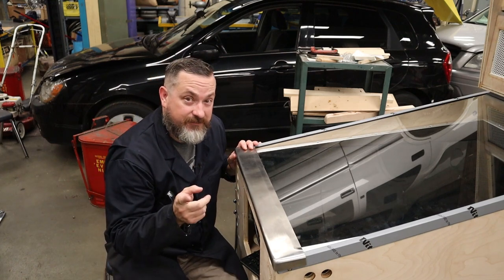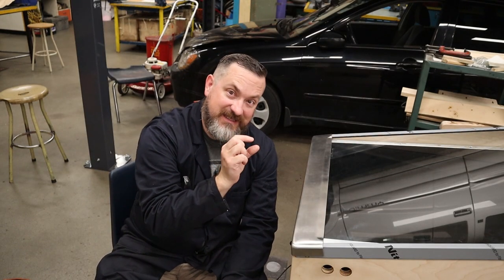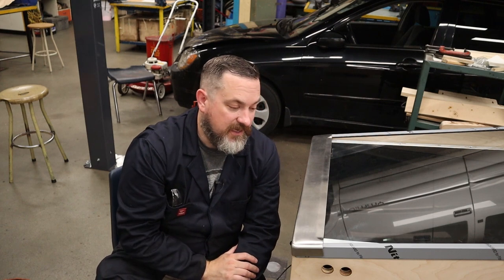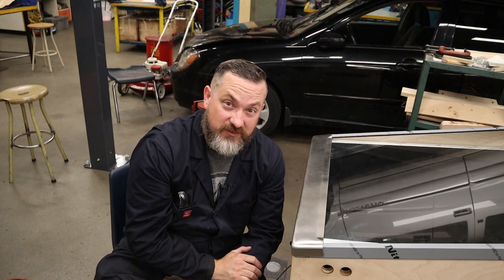So on to the very last step for everybody, which is the beer foam seal tape. The idea behind the beer foam tape is that you put a strip of this kind of insulation tape on the underside of your lockdown bar. That way, if you ever spilled something on the glass, it doesn't just run into the cabinet and cause a bunch of damage. It gives you a couple seconds to go grab a cloth and soak it up before it goes in. Now, in my mind, it does another purpose, which is probably more what it was intended for: it provides a little bit of cushion in between the hard stainless steel lockdown bar and the extra hard tempered glass. So if somebody has a bad game and smashes the lockdown bar, you don't have your glass shattered on you.